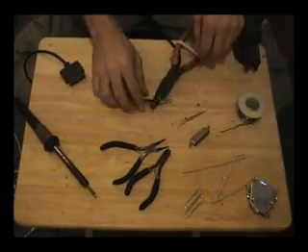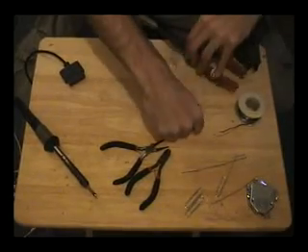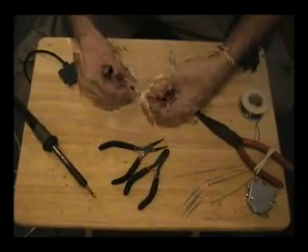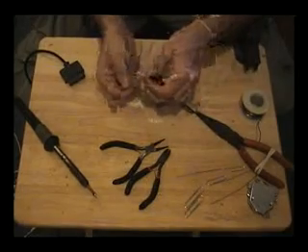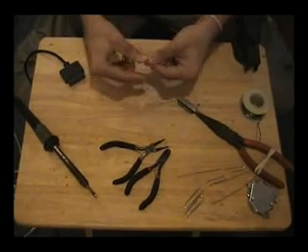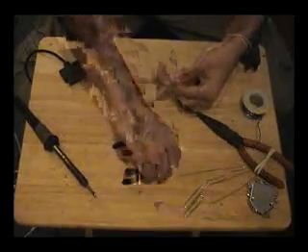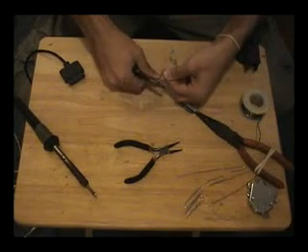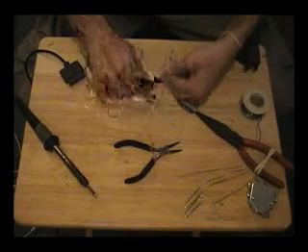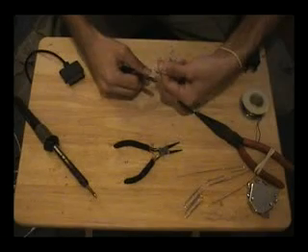The first thing we're going to have to do is get our printer port all ready. We need to go and solder diodes into the appropriate places on the printer port. I'm going to line all of these up and trim them down, because we don't need leads this long. If you saw episode 2 of BSOD, you'll know that diodes are one-way gates for electricity and you can't hook them up backwards. So the number one thing with this project — if you're having problems, make sure your diodes aren't hooked up backwards. It's a common problem in such a simple schematic.